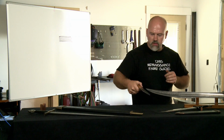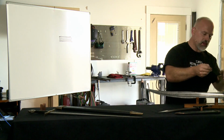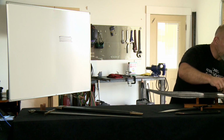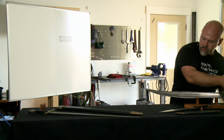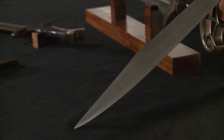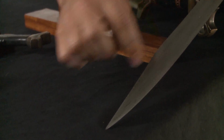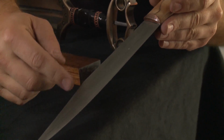Here's an example of a sax that we welded up. This is Van's sax at Arctic Fire 2012. This is kind of a collaboration between all the guys. See this edge material here? That edge material has been rotated 90 degrees so that you see the edges. Think of it like the pages of a book. So if I had a book and I were to rotate it up so you saw the edges of those pages and then did that, then you would get these edges here. You got some twist bars up here with these little spirals.